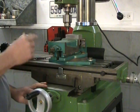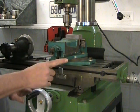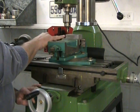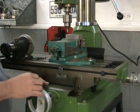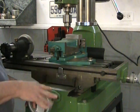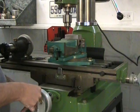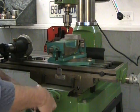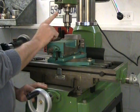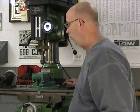I can visually confirm that I'm directly above my reference surface, so I re-zero the scale on my Y axis. This axis is set. I can now move the tool to the position of my first hole, always coming in the same direction. Note that I'm not making a mark because I'm never going to back this axis up — it only moves in one direction. Hole A is at 0.5 inches in Y, so five full turns: one, two, three, four, five. This time I didn't go past, so we're directly above the position for the first hole. First hole done.